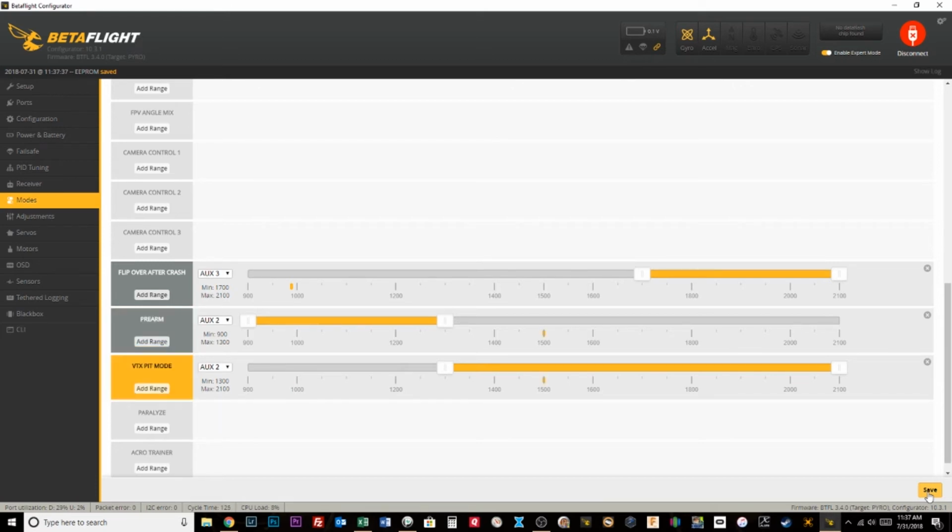So Flight mode 1. For team racing, your quad gets plugged in while another pilot is in the air. So it's important that you've got independent control of the VTX beyond just the pre-arm. For team racing, you definitely want to do it the original way I showed you, with a separate switch for your VTX pit mode. For individual racing, this would work fine, where you just have your pre-arm on the inverse of your pit mode.